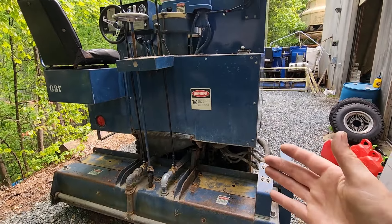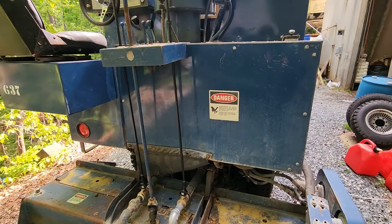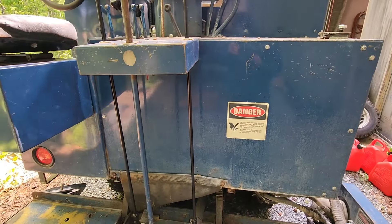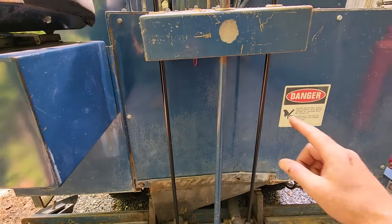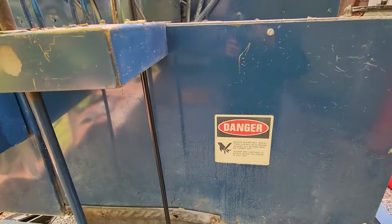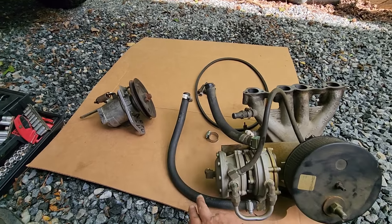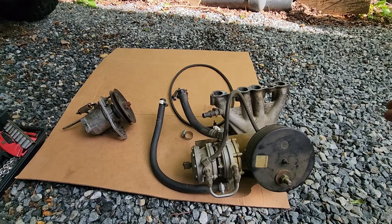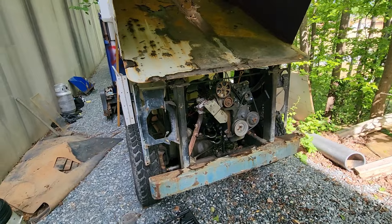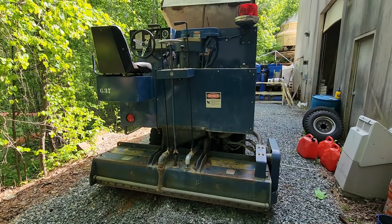As you can see this has a smooth back panel here, and originally I was just going to bolt our tank bracket here, but I believe I can actually use both panels from the other Zamboni. That way we don't have to drill any holes — all the holes will line up correctly in the correct spot. And here's our vaporizer and our carburetor and intake manifold assembly along with our governor. We're going to replace these hoses right here because it's cheap insurance while we're right at it, and also like we stated we're going to change those belts too.